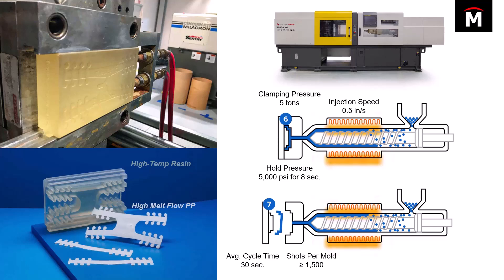The reason they had to go that route is because the mold is made of plastic, not metal. As such, it's not able to conduct heat away as easily, so there's a lot of heat retention. They have to leave the part in the mold for a little bit longer. Formlabs even recommends using some compressed air to help expedite the cooling process.